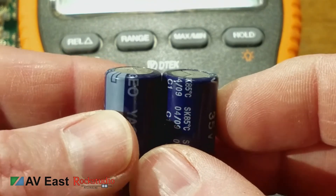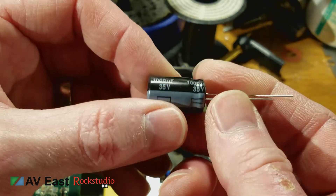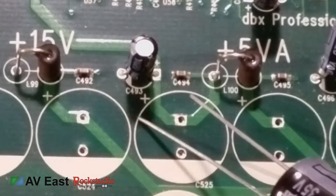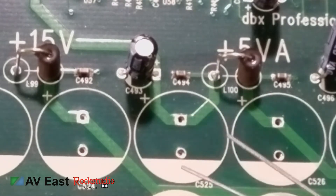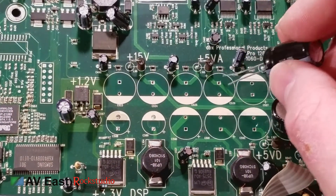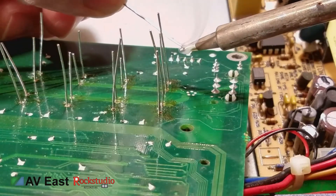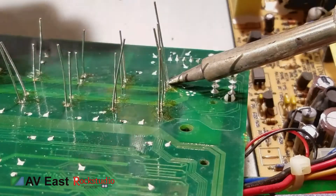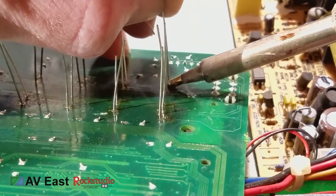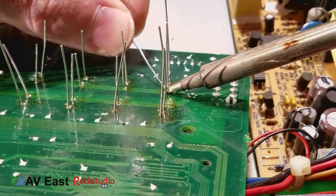Here's a bulging cap versus a normal one. Take a look at the fine print on the side and you'll see that these are rated for 85 degrees Celsius, produced in February of 2008. The Panasonic caps I'm replacing them with are rated for 105 degrees Celsius. Take a look at the circuit board and you'll notice the little plus sign and the square solder pad — that's going to be for the positive leg, which on these capacitors is the longer one. The round solder pad is the negative. So line up the shorter leg and the negative symbol printed on the side of the capacitor with that round solder pad. You can start by putting a couple capacitors through and then solder them in from the back. Wet the tip of the soldering iron with a little bit of solder, then heat up the leg and the pad at the same time and wait until you see the solder wick its way into the hole. These capacitors aren't super sensitive to heat so you can feel comfortable soldering them in pretty well.